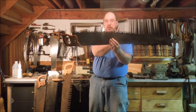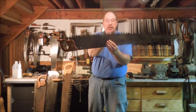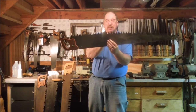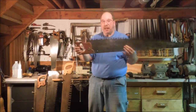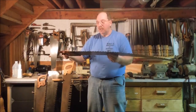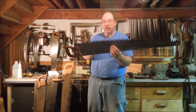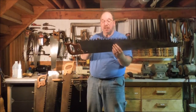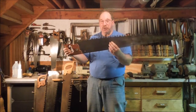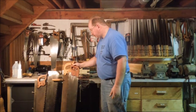You can only cut a piece of wood about half the length of the saw, because you want to be able to get the chips out of the center part — it has to be able to exit the wood as you're cutting. The big teeth allow you to take a bigger cut, have more sawdust, and let you cut faster through green wood.